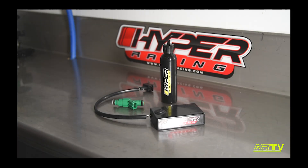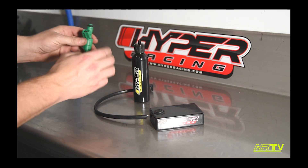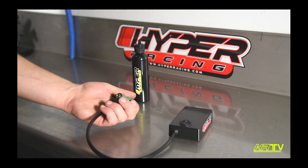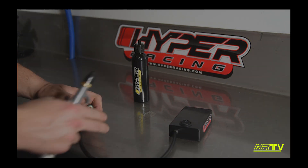Then we need to force some hyper fuel system lube or a high quality air tool oil through the injector nozzles. Do this by placing several drops of lube into the top of the nozzle, then pulse the nozzle while forcing compressed air through. Or you can always send the nozzles to us for cleaning and winter preparation.